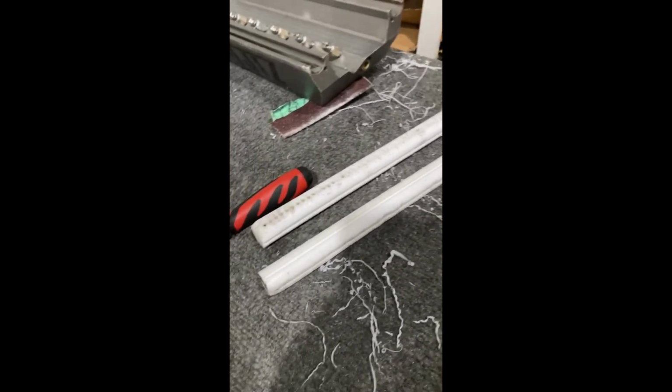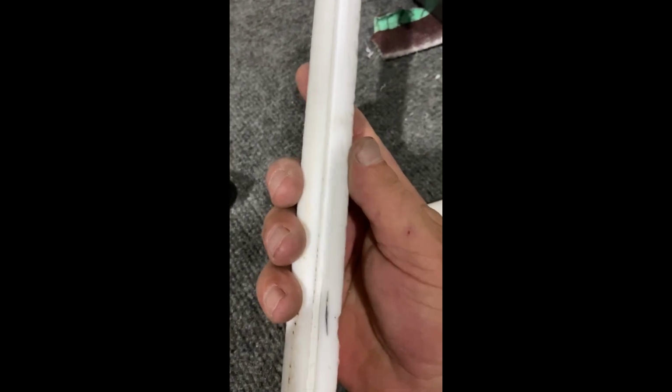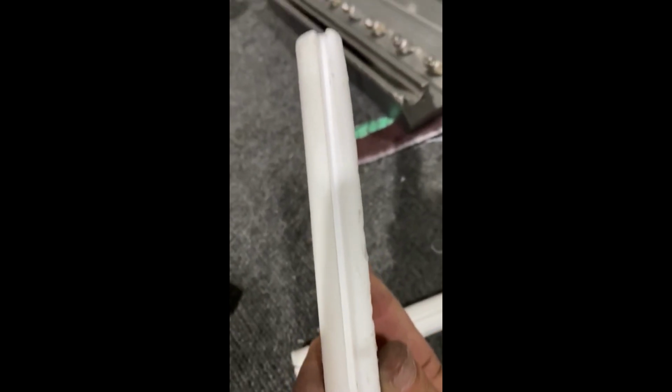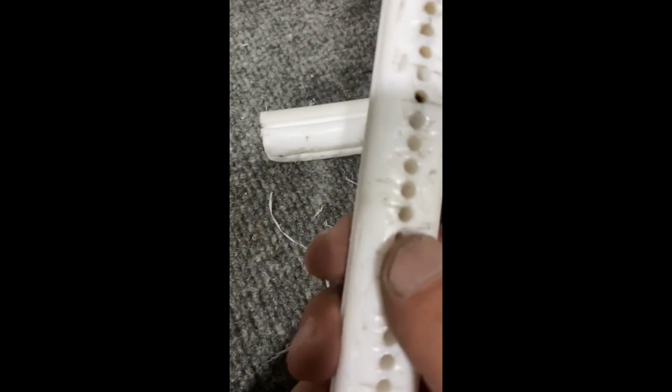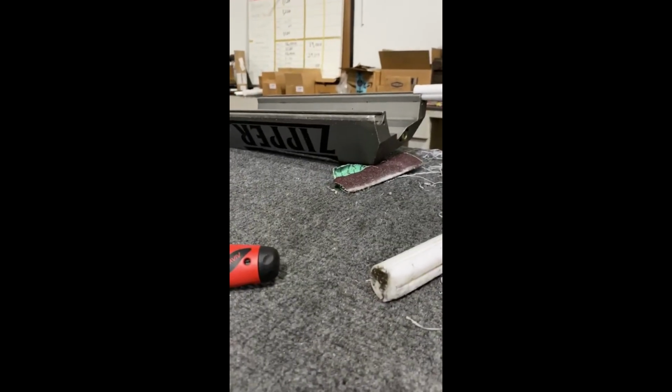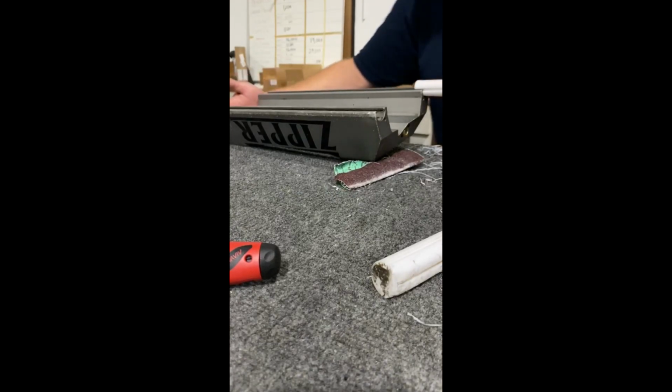Okay, as you see, I explained this one wasn't cut on the equator. It took me a few minutes to do this. This is called a Widowmaker. It's a deburring tool. And the side that needed cut, because this wasn't on the equator, this is a pretty old machine. I looked at the serial number. So one of the first ones before we had some tolerance issues fixed, this wasn't cut exactly on the equator. So I was able to take that tool and cut it on the side that he was using and pulled it off of the right edge there. And this will slide right in. Let me put the camera back. The other glide, perfect. So this will slide right in.